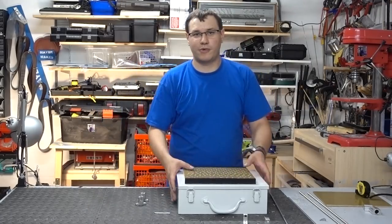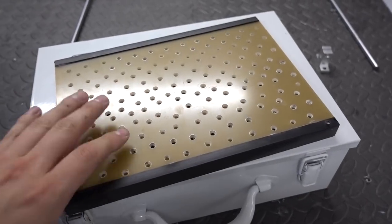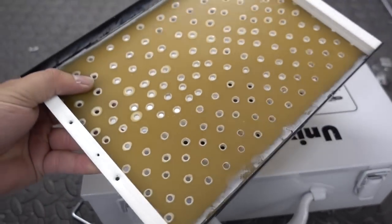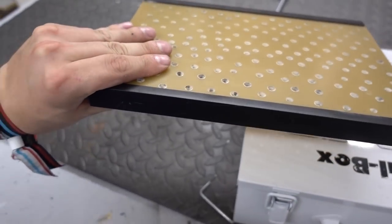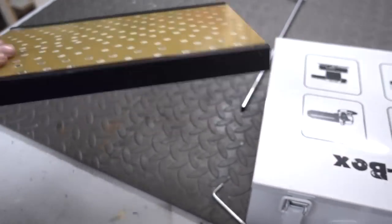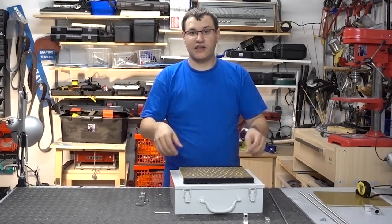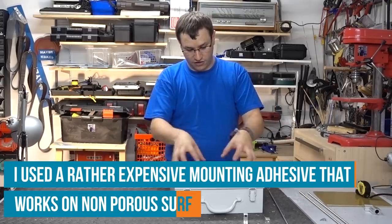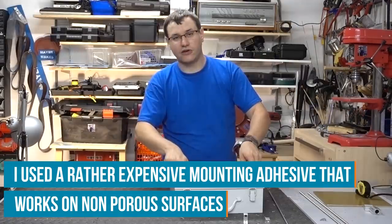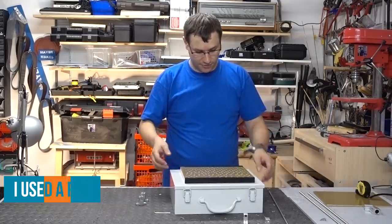We have built the bottom portion of our machine. This is the vacuum box and this is the build plate. I have glued some random plastic parts on it — those parts are pretty heat resistant, so there shouldn't be a problem. I will glue this part to the box and seal it so the vacuum only has to be inside this little area and not in the complete box, reducing the chance of leaks.